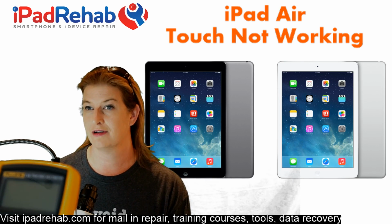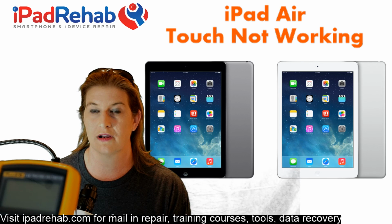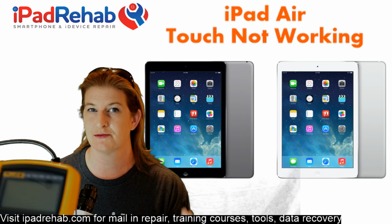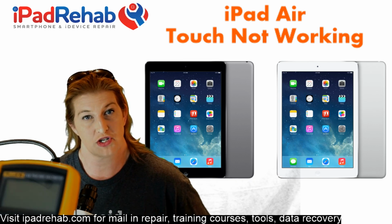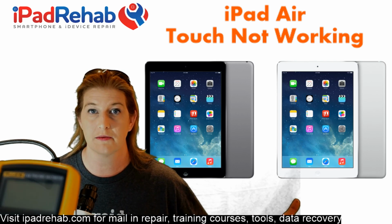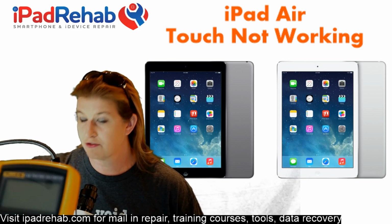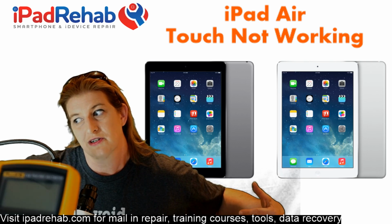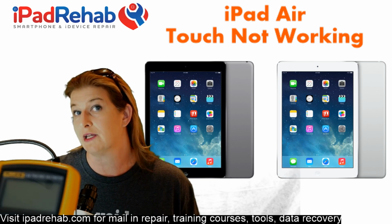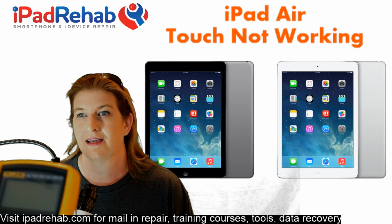Run a jumper from another 1V8 source. Will affect battery, but work at least. Will it affect battery? Let's think about that. Let's think about the difference between voltage and current. Voltage is a push, a pressure. I can fill up an artery with blood, but if I don't have a heart pumping in order to actually produce flow, then I can maintain a blood pressure and it just stays there. So if I just filled up that line, if it didn't have a hole in it, if it didn't have a short to ground, then I could just fill up that voltage and let it sit there.